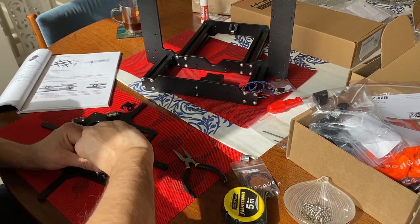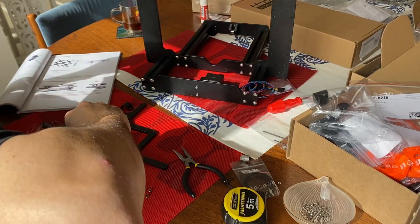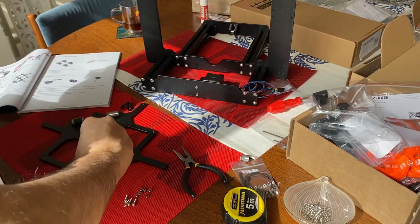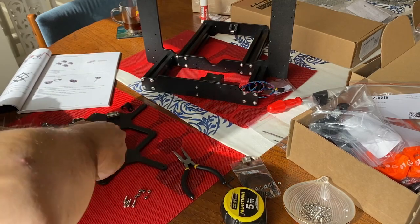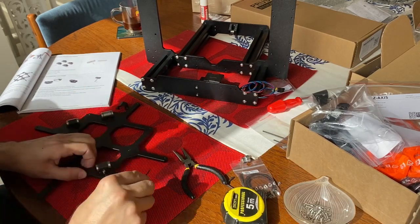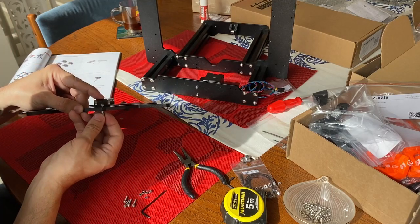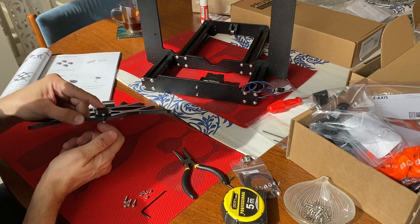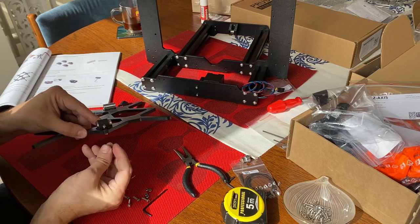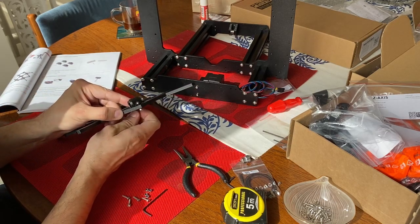But you can see that the bearing has 2 circular lines, so those should be aligned from the left and right side. For example, they should be protruding the same amount left and right. Tighten it with the Allen key, just enough. The lock nuts will serve their purpose. They will prevent them from loosening up with time. Start with your finger, then later on you can use the Allen screw coupled with a plier. So one is almost done.